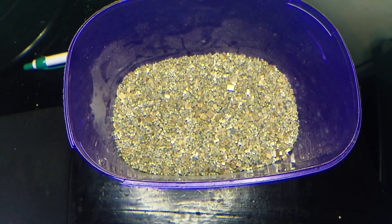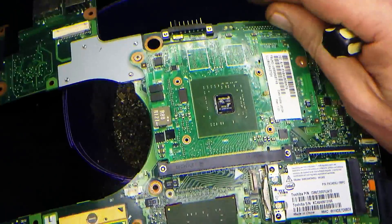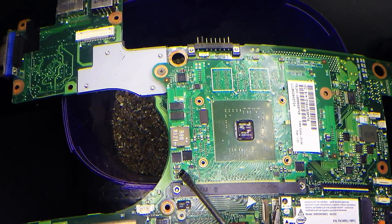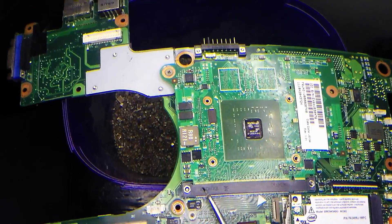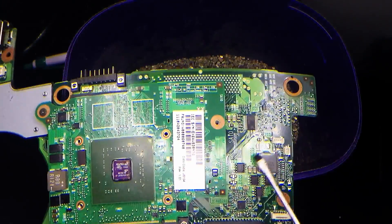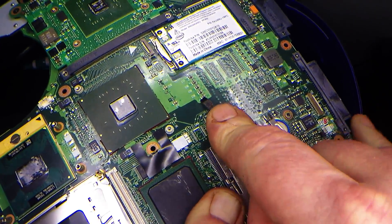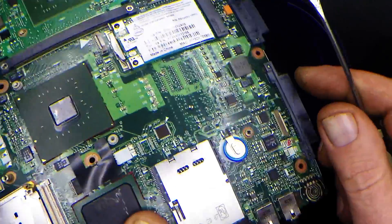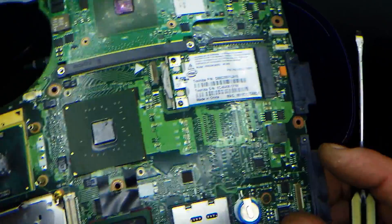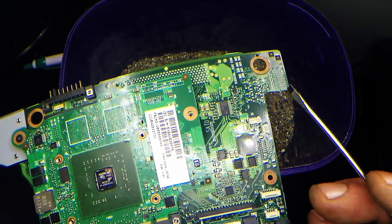Let's have a look — okay, this is a laptop motherboard and there'll be MLCCs all around it. Looking over here, there's a tiny one, and then there's two next to it — these two are Cs, the last one is an L. So if you scrape all three of these, this one is not going to be what you want. I'd suggest not to scrape things off the boards blindly. In this case, these are very tiny but they're all Cs, so they're all MLCCs — you can run your screwdriver along. But when there are so many and you can't really read the writing, most likely they're going to be mixed up with inductors as well as capacitors.